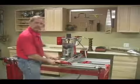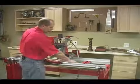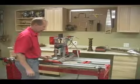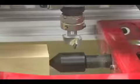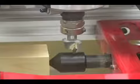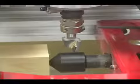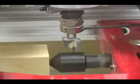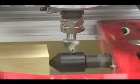I open the split nut on the X-axis so that I can slide the carriage, and then we're going to place the router bit down onto the bullnose center. So we'll just bring it down to this end. We'll lower the router bit till it gets close to that. We'll move the router back a little bit. Now at this point, we can loosen the eliminator chuck and just let the router bit come out of the chuck, and it's going to rest right here on the bullnose.